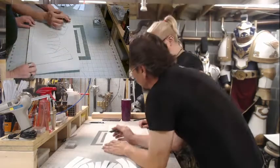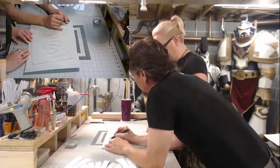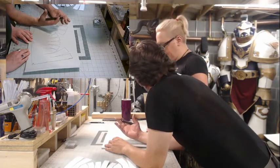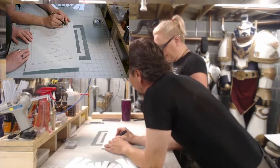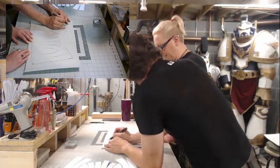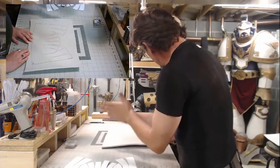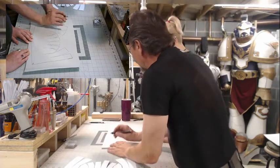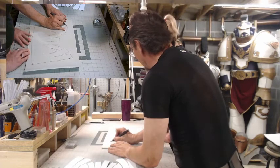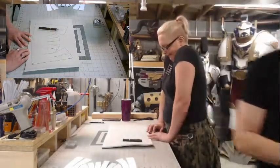Okay, so some of the things you want to remember when you're cutting. You want to start before your line, the same way as you do with fabrics. So I would start the blade like here, and then drag it down along. Once you get it going, you want to make sure that your blade's not wandering left or right, because that'll give you that nice perpendicular cut. What I tend to do is use my pinky. Once I figure out that position, I keep it there and just lock it in. Okay. There you go.